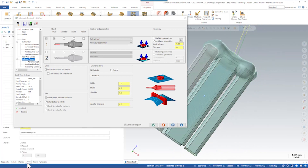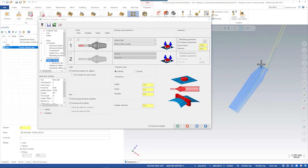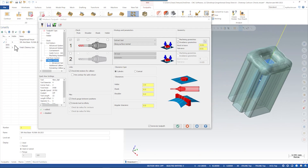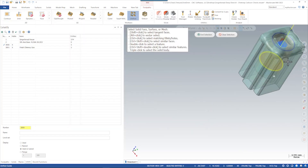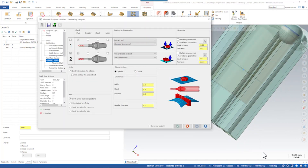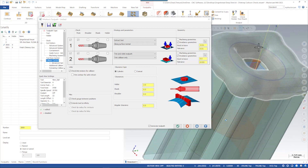If I turn off the level, you can see that we start to get this hourglass shape where we're now waiting until we get under the snow to finish that roof. The next thing we do is apply our stop surface. We've got this flat surface down here, so we'll say trim and relink to another avoidance body being that one — and now you can see the toolpath goes way down below here. When I preview that, the toolpath now stops when the cutter touches this flat face.